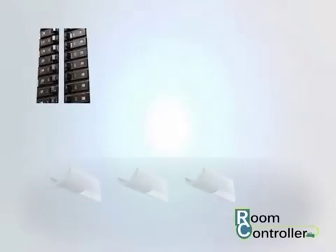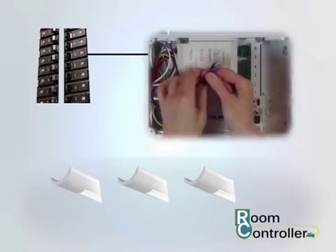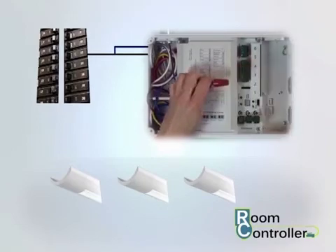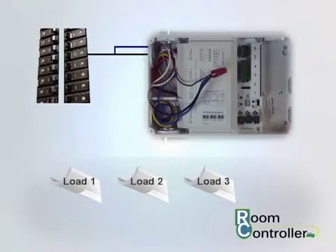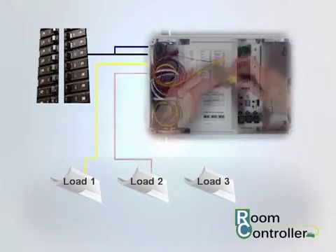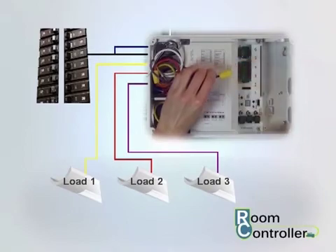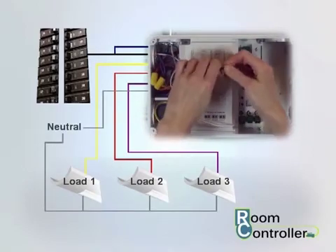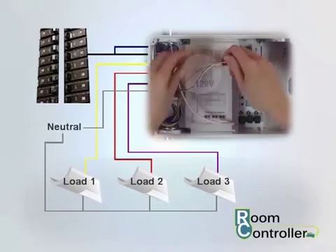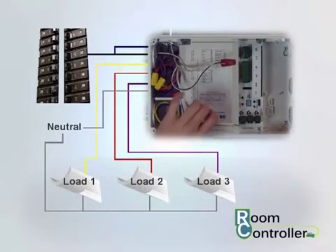The feeding circuit will provide power to the controlled loads as well as to the room controller's microprocessor. Connect the de-energized incoming circuit to the transformer's black line-in wire and also to the blue load-in wire. Identify lighting load switch legs for loads 1, 2, and 3 per your application diagram layout on your QuickKit box. Connect the yellow lead to the wiring for load 1, the red lead to load 2, and the purple lead to load 3. Run the transformer and load neutrals to the neutral bus bar of the feeding breaker panel. The transformer neutral wire is the white wire with the black stripe for 120 volt applications, or the white wire with the orange stripe for 277 volt applications. Cap off all unused leads.